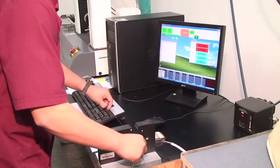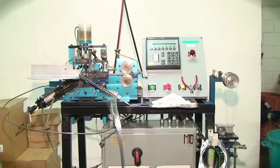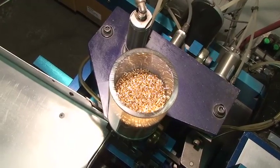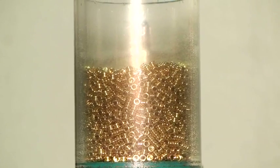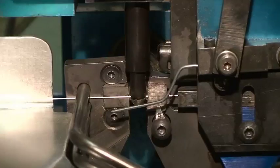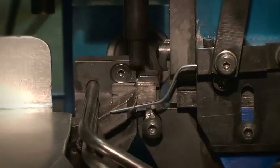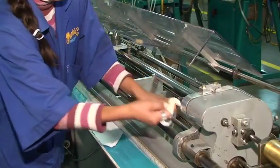Visual and physical inspections are made to ensure superior performance. The production process starts at the ball end machine. The brass ball ends are loaded into the hopper on the ball ender. Wire is fed through the machine, wrapped around the ball end, and then a twist lock is put on to hold the ball end in place. String winding starts with the ball ender.